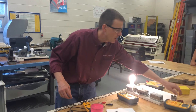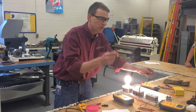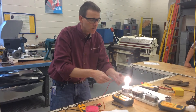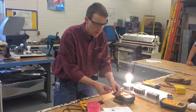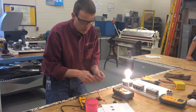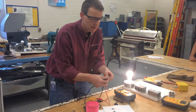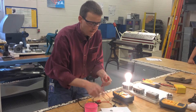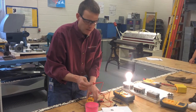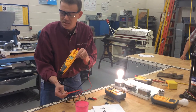When you're measuring a wire — whether it's a test lead or whatever — generally if the wire is good, it will measure zero resistance. These leads usually have caps that stick on; you might have to remove the cap. If I wanted to measure the resistance on this test lead, I can unscrew and pull off the cap, and it should read about zero or one ohm — a very small amount of resistance.